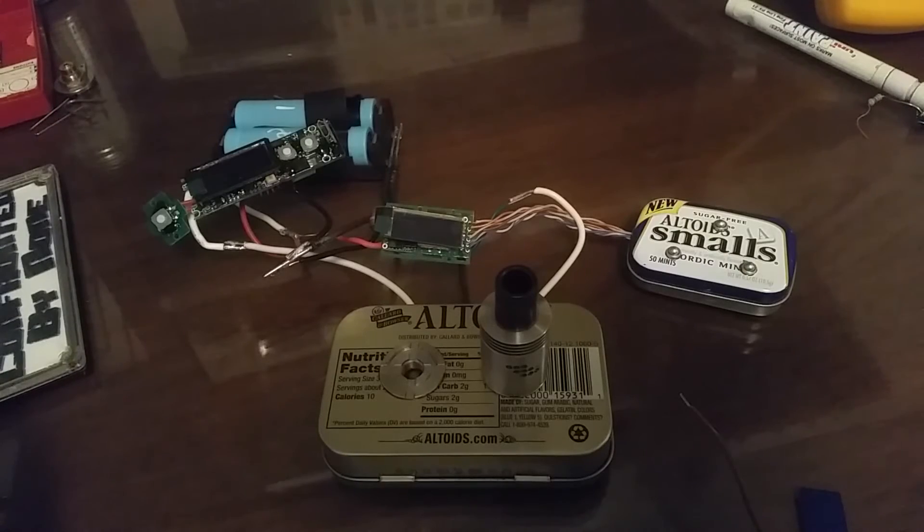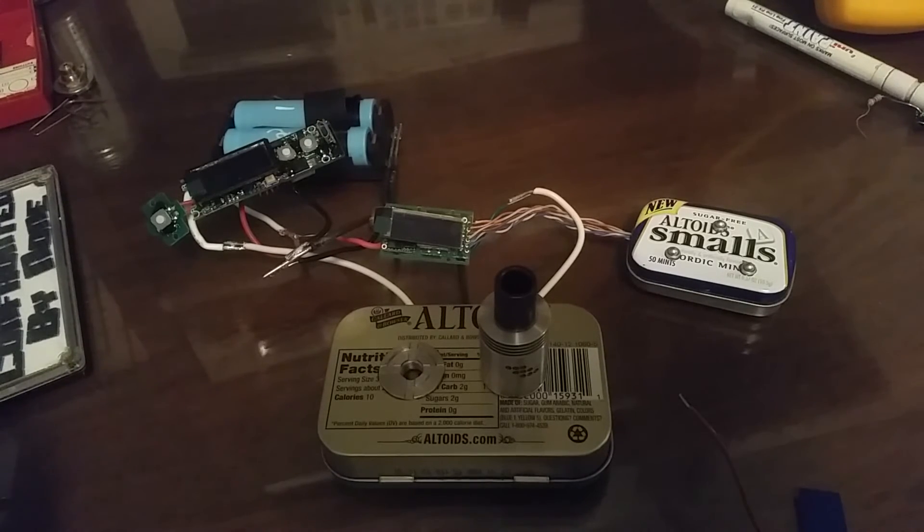They're close. This is the one place where the SX was noticeably better than the DNA40, which I was somewhat surprised by. The SX efficiency was from about 96.5% down to about 92%, whereas the DNA40 was about 90.5% down to about 88%. That's not a huge difference — it's about 6% to 8% from the best of one to the worst of the other — but is it a showstopper? No, by no means.